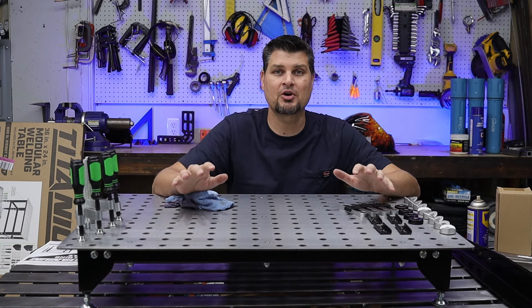I'll end with a pro tip: this is a steel table and it will rust with any moisture or water that gets on it. The best thing to do is just do a quick spray of some WD-40 all over the table every now and then. Yes, it will leave just a very slight film, but that will protect it from any rust — especially coming into winter, I'm going to need that for sure. That's all I got. I'm Mechmaster — we'll see you next time.